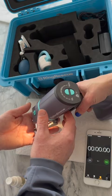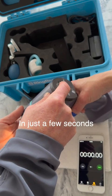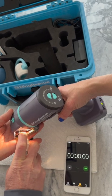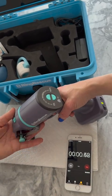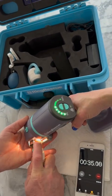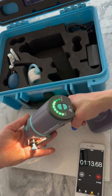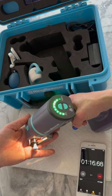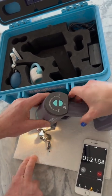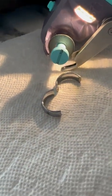The second cut is going to go right there. Just like last time, we slip the guard underneath the ring, press the up button to bring the ring in towards the disc, apply a little lubrication right to the cutting interface, and start the cutting. And we're through that ring — look at that! Cutting tungsten carbide safely — cut into two halves, two pieces. Easy ring removal, safe, no problems at all.